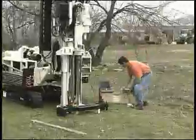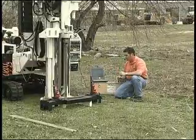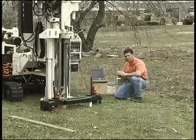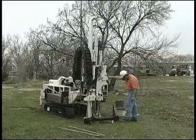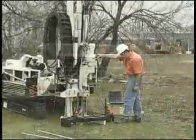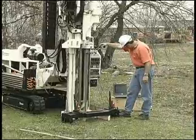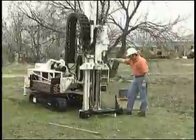With the sounding now going and acquisition ready, I'm going to press start on the software. This is going to enable it to start taking readings. With it recognizing readings, I'll be able to see my tilt angle, and I want to get it as close to zero as possible — though one degree of tilt is typically okay. As I'm pushing, I'm going to make sure I see my rate of speed. Our rate today is going to be 20 millimeters per second, which is typically what's used for CPT work. I also want to make sure I'm still receiving sound to confirm no faults have occurred. Most importantly, I want to make sure I'm going straight — if I go off at too drastic an angle, it's risky for the cone and compromises the accuracy of data received in the vertical direction.